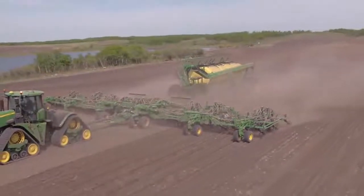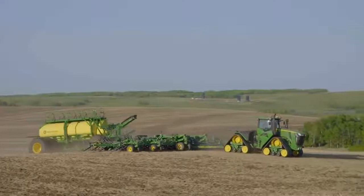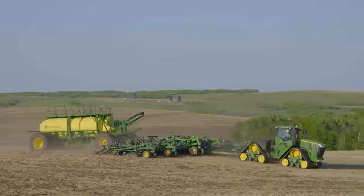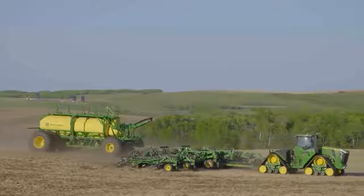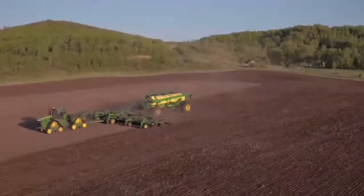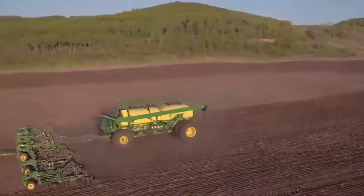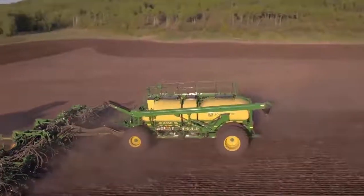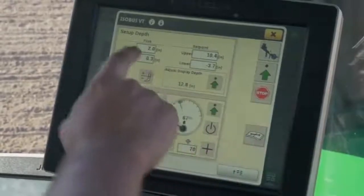Based on your commodity and soil condition you may need to make adjustments. If needed, you can shallow up or deepen the shank to make sure you are getting good seed-to-soil contact. For instance, if you shallow up the shank, you are also shallowing up the seed tube — you will need to adjust the seed tube in this case, or you may not even be getting the seed into the ground. Customers also have the ability to set a flick up or down setting on the tool, which allows operators to make small incremental adjustments to the depth or height just by flicking the SCV without detenting.